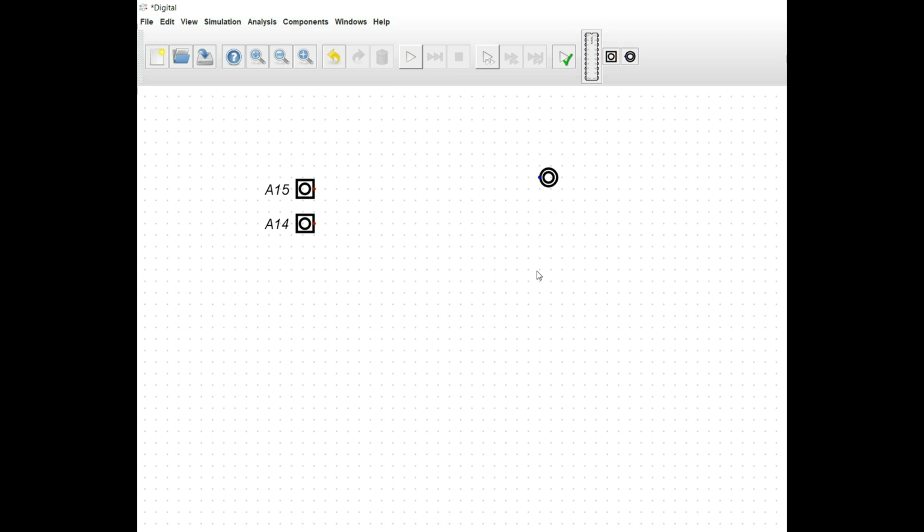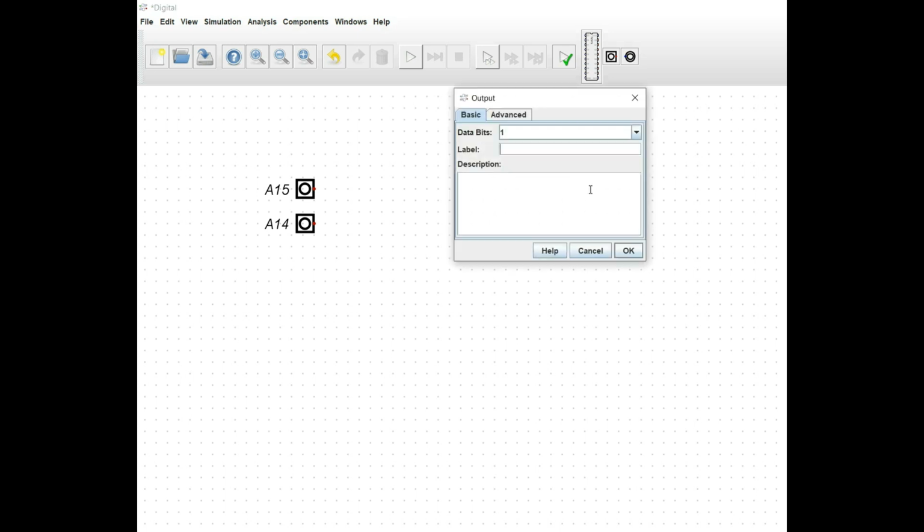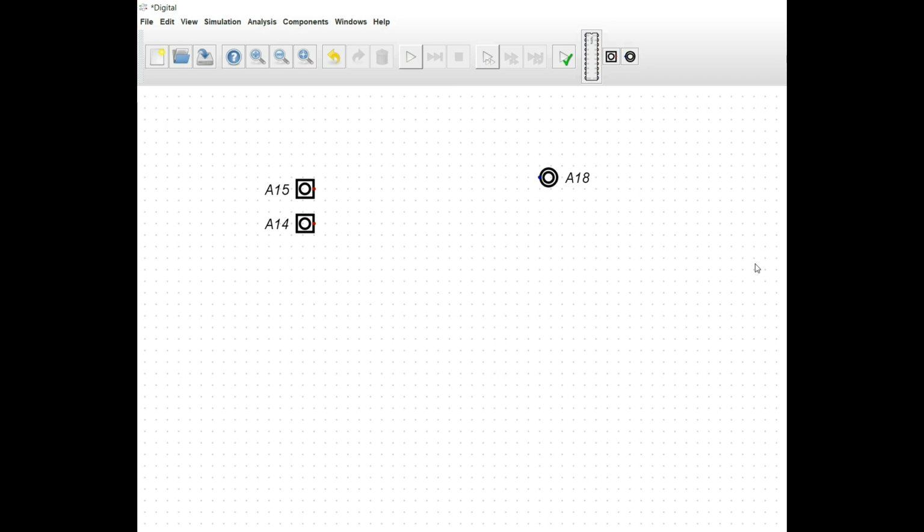Okay, and that complicates things because we know that with a 512 kilobyte address space we're going to need a few more address lines. We're going to need a total of 3 extra, and what I mean by 3 extra is that on a 512K SRAM, the highest address bit is going to be A18. So, knowing that, we know that that's the top.